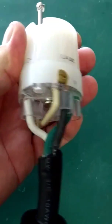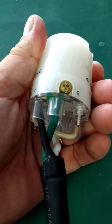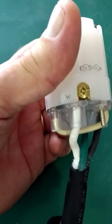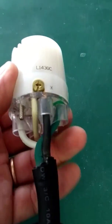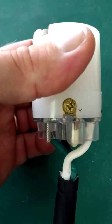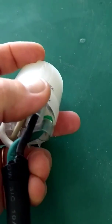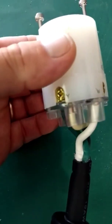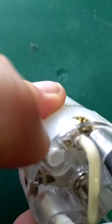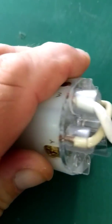For the wiring: put your green wire to ground, your white wire to the terminal marked W, and your black wire — which carries the hot — to either X or Y, it doesn't matter which side. Then you need a jumper wire feeding from X over to Y so that both sides of the transfer switch receive power.